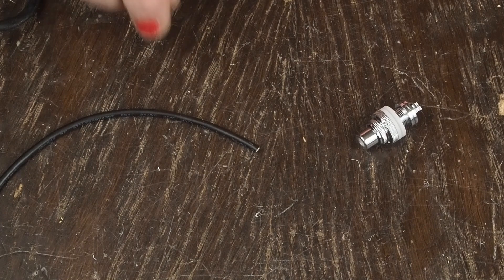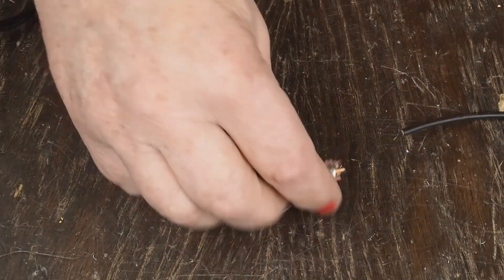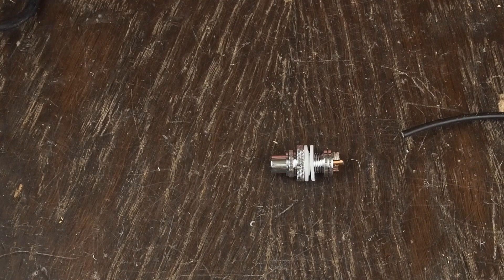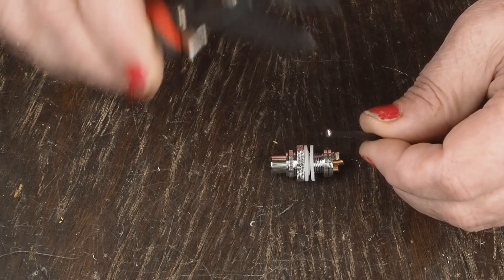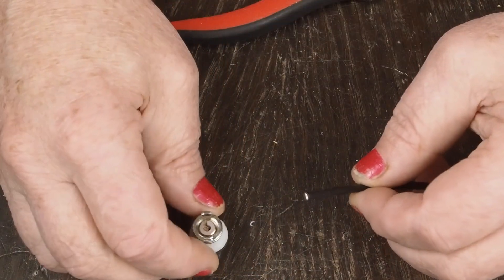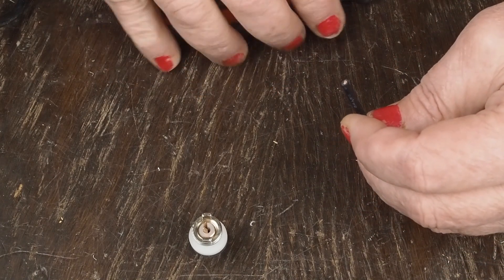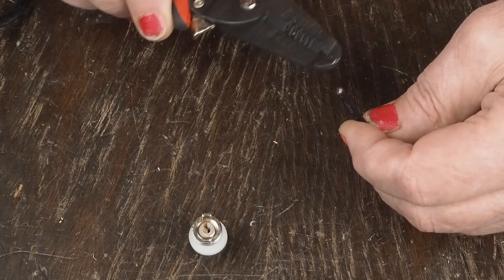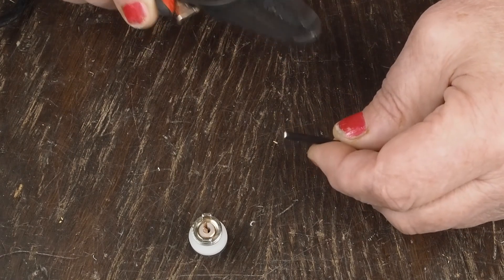The thing I want to show you is how I hook up the RCA jacks and the cable I use. I use this two-conductor shielded cable I get from the guitar store — I think it's used in wiring up pickups. Instead of using a single conductor with a shield, I use two conductors with a shield, and I'll show you why here in a moment.